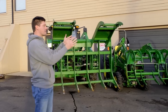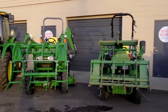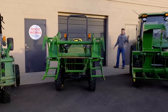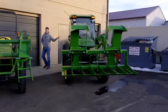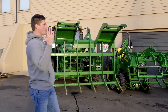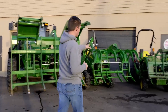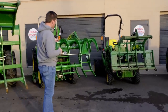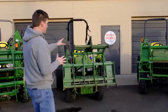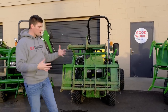As you can see here, there's a great assortment of tractors: a subcompact in the middle, a couple mid-sized compacts, my 4066R on one end, and my big five-series utility tractor over here. A grapple like this is going to weigh around 1,100 pounds — obviously way too big for the other tractors. A brush crusher is going to weigh somewhere in the 300-pound ballpark, and a mini grapple, perfect for a subcompact, weighs around 200 pounds give or take.